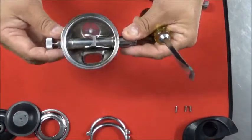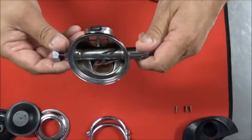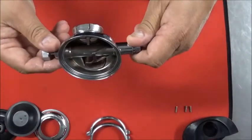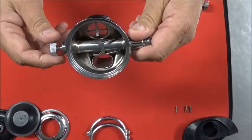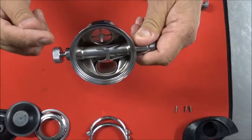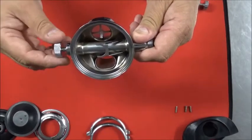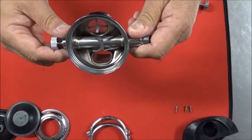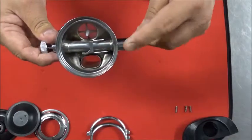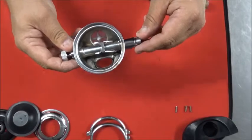because not everybody's going to be using the inline adjuster, which makes it a little more challenging. But that's a good way to start, and that gives you a little illustration of how the only thing the adjustment knob is doing is putting more tension on the spring, which is putting more pressure on the poppet to push it against the seat, the face of the volcano orifice. This will never change lever height. The volcano orifice does, and that's the important part of setting this one up.